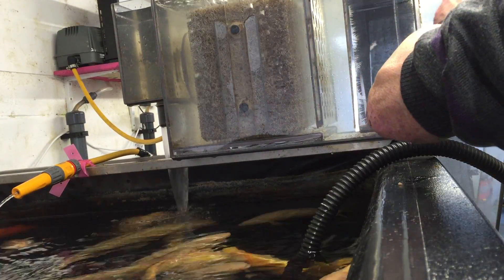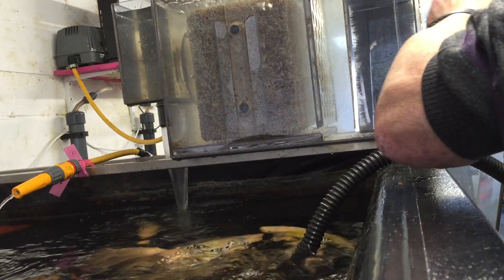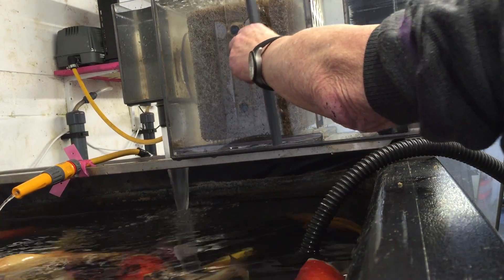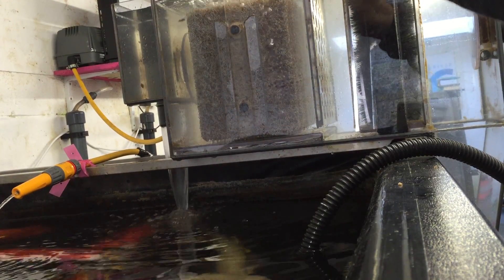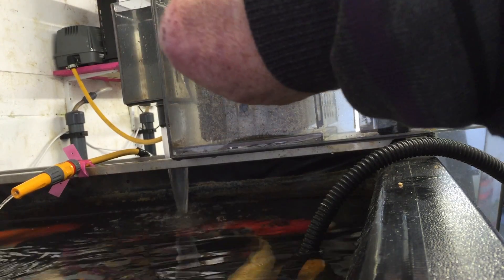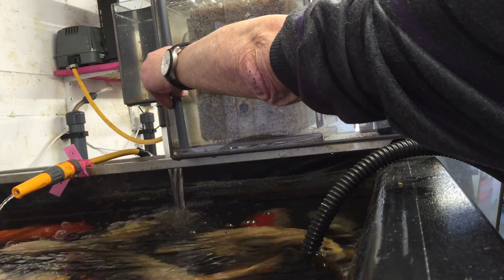And this continues until the pump is turned off. So initially upward, and now the filter's running, it's pure horizontal flow. And although this is situated high, the actual exit is the same level as the inlet baffle. So the entire water is moving forward now as a block.